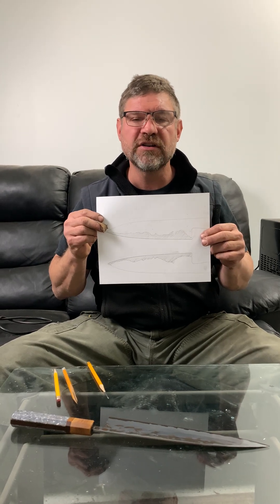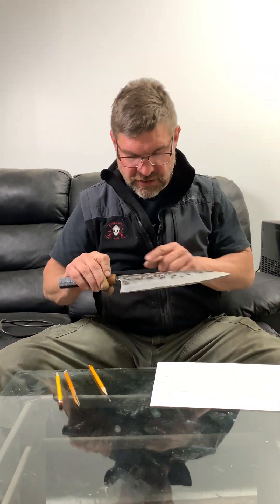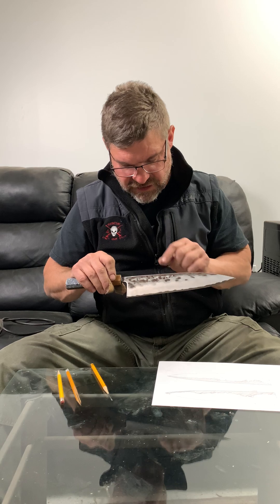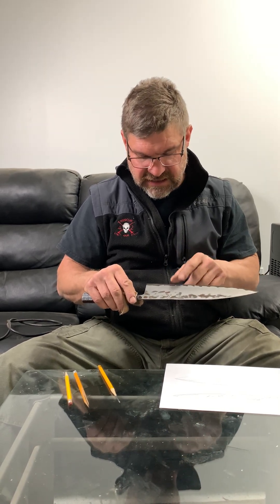The next thing: forge it thin — really, really thin. Often this kind of uneven grinding occurs because the blade was left too thick before grinding. Grind it almost down to your final thickness. You can see the final hammer blows right on the surface of the metal, so you know the edge was not much thicker than it currently is when it was forged.